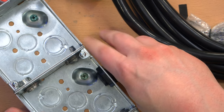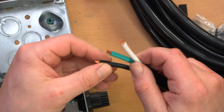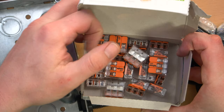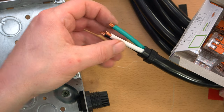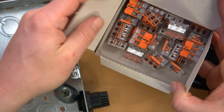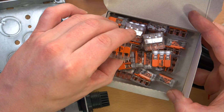Okay, that's pretty solidly on there — I mean, it's a plastic nut, so it's as solid as it'll ever get. Now I have some brand new Wago lever nut connectors, and I'm going to be using these inside because these are rated for both the 10 gauge stranded and the 12 gauge solid copper. It's a far easier thing to make up than using wire nuts, and these are properly rated. These are genuine Wago — they're not a knockoff. There are tons of knockoffs out there, so just watch out for those if you're trying to do a serious electrical installation.